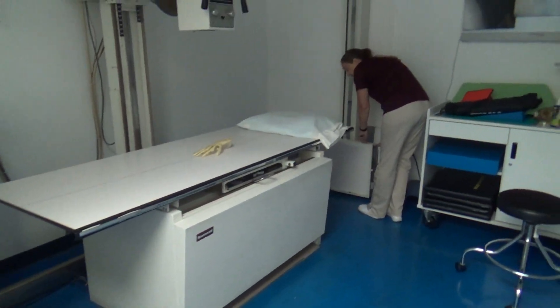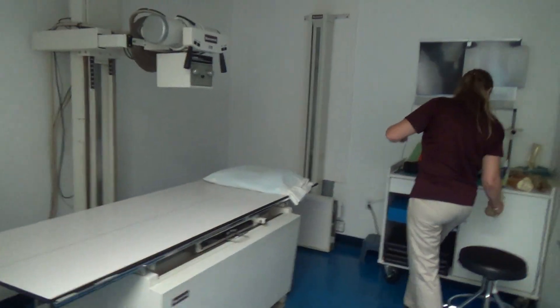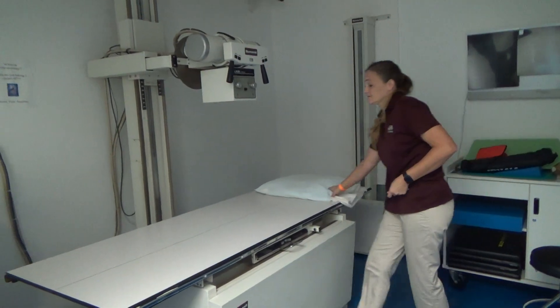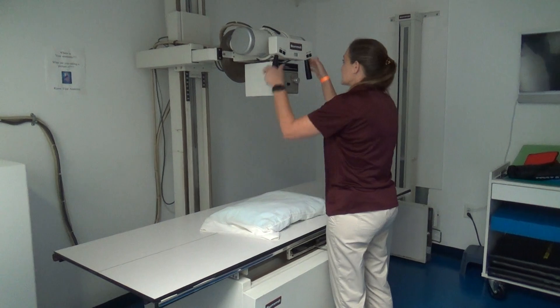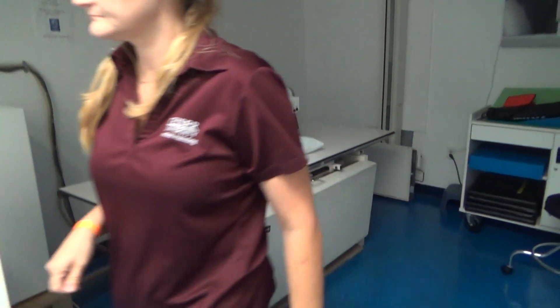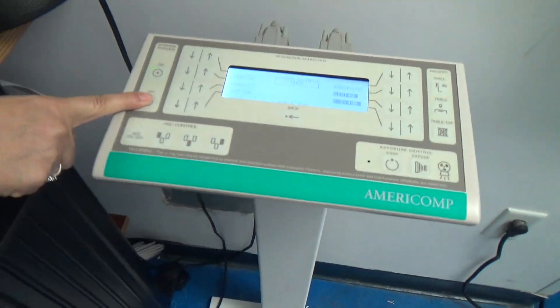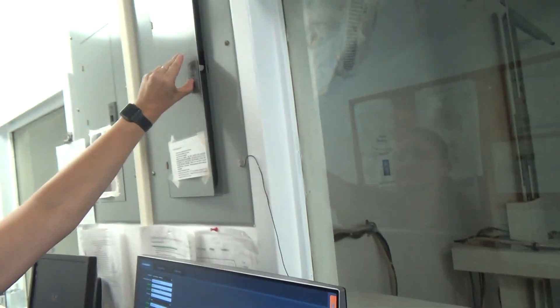Is there anything else that you think we should add to this? When you're done for the day, make sure that you put your machine to rest so that when the power goes out, it doesn't disengage the locks and stuff comes crashing down. Put it on a nice pillow to protect that housing, put it in the back. Turn off your control panel first, and then your main power switch.